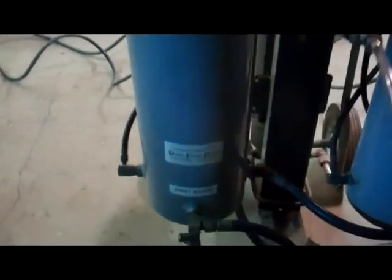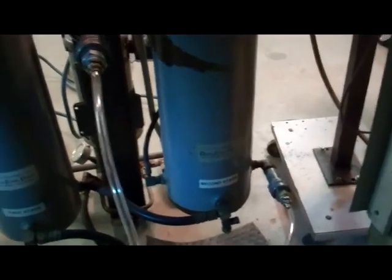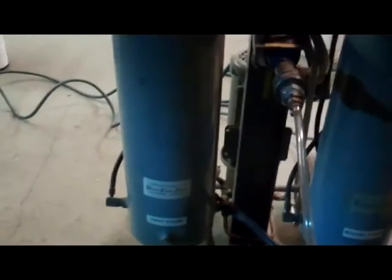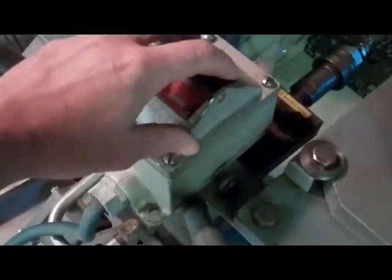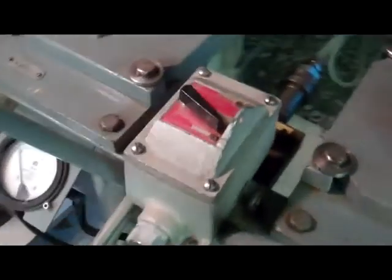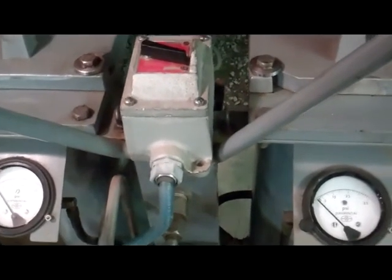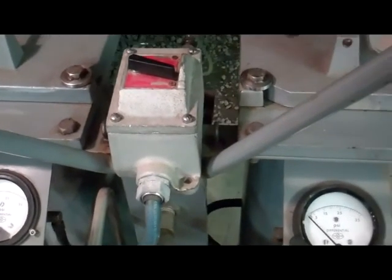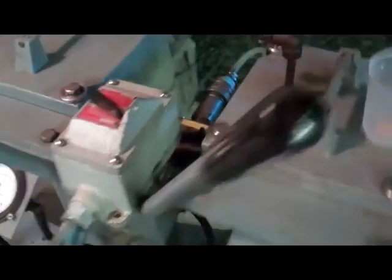We have clay in the first stage, and in the second stage we have a particulate and water-absorbing media which will help deal with any remaining free water. Let's kick it on — 220 explosion-proof. We're running diesel so that's not a concern, but this is one that was designed and built for use in a refinery.